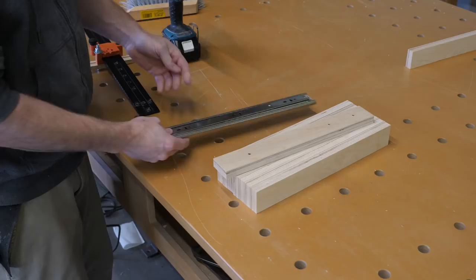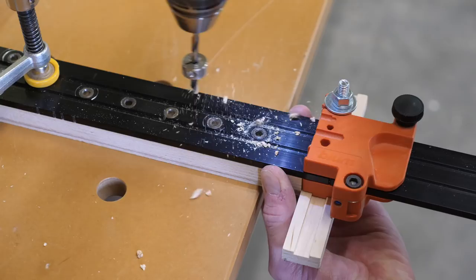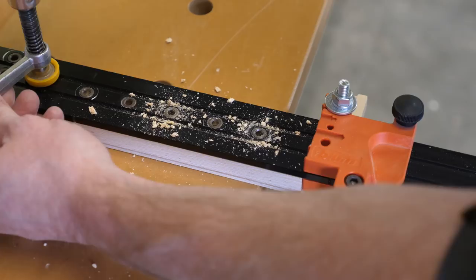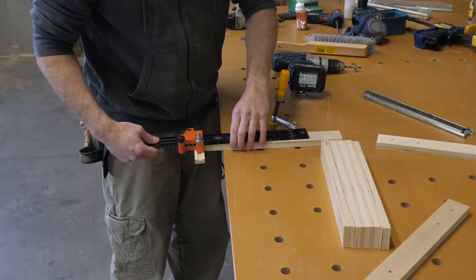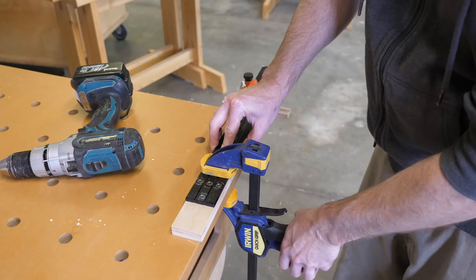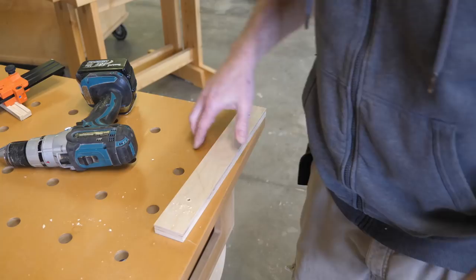It's time to install the drawer slides. I use the Blum universal drilling template and a 5mm drill bit with a stop collar. The jig is set to drill the first hole 37mm from the front of these plywood strips I milled up. The 37mm measurement is a cabinet industry standard for hardware holes. By drilling this hole in the right spot, the drawer slides will be installed accurately from front to back within the cabinet. After drilling the first and second holes, I make an adjustment to the jig and drill a third hole, which will carry the back of the drawer slide.